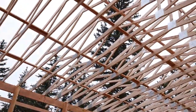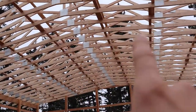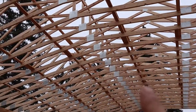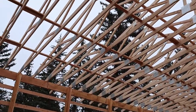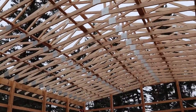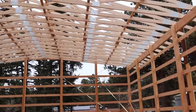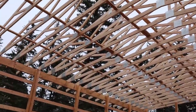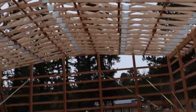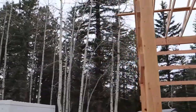Okay, so these trusses are 2 foot on centers. They're a scissor truss, which means they're vaulted. They are 2x6. The engineer said I had to do them 2 foot on center or four foot on center, so we just chose to go 2 foot on centers, which will help them because they're going to do some finish later. So I already got these lateral horizontal stiffener bracing, called for like 8, which is a lot of them, but I still got to do all the end wall stuff.